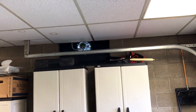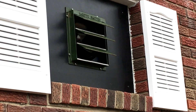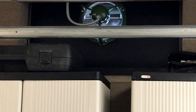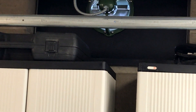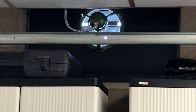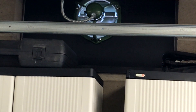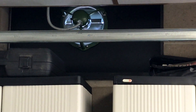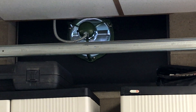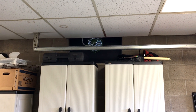One more shot — this is the final product outside. Yeah, it's a real nice clean install. Before I wrap up, the only thing I had to do for the exterior shutters was lubricate the hinge points so they would easily open and close. Again, the whole thing was never used in the last 60 years — this is the first use it's ever seen. Put some drops of oil on it, put oil in the motor, and it's perfectly fine and will be perfectly fine for decades to come. So that's the ILG Model 83 from the mid-50s, happily purring away up there doing an excellent job. Thanks for watching — hit like and subscribe.